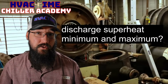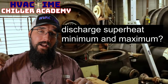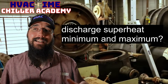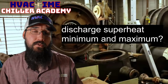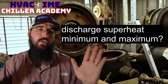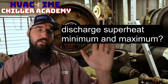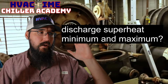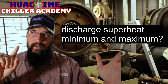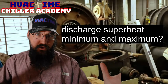Now, if I've got a lower load condition, but yet I'm running a 25, 30 degree discharge superheat, I'm going to start asking questions, because that's that whole dilemma you fall into. Just because these are the parameters, these are your min and max. So if I had to put a hard number to it, 15 min, 30 max. I'll circle back around on the max in a second, but there are some hard numbers.